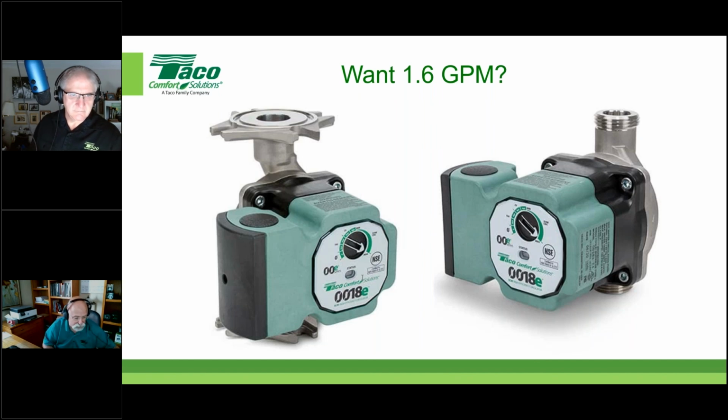Unless, John, you want to take a stab at it, in terms of the flow restriction through the pump itself. Yeah, I'd have to look up what it is, but is it a major concern? Not that I've seen. Again, the bigger player here is your pipe sizing. What you have is momentary pressure loss more than flow restriction.